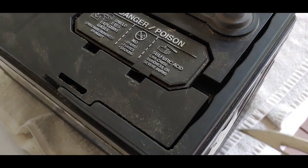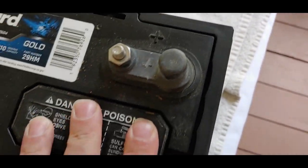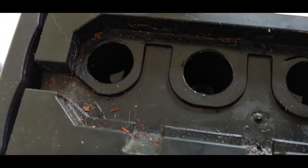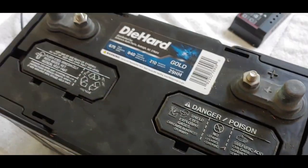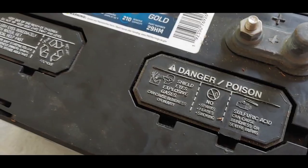Since we're talking about that, let's go ahead and do it. We'll pop it open and check — the water levels are good, though I'm going to have to clean this off. That's what happens when you use batteries a lot. I have bought some inexpensive lithium batteries used in a couple of videos, but mostly the bulk of everything I do is with lead acid. Plenty of water, also needs to clean off a bit, but it will be good enough for our testing today. Make sure you keep these down tight, and remember when these are charging they vent, so you don't want them in the house — you want them outside somewhere safe so they won't cause an explosion.